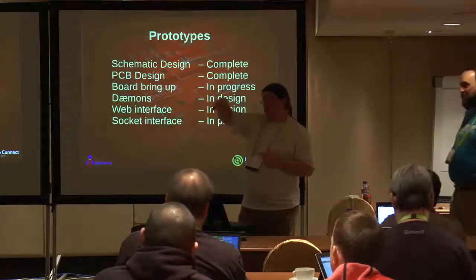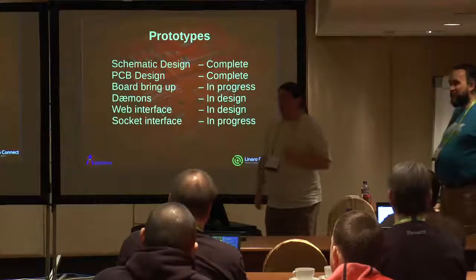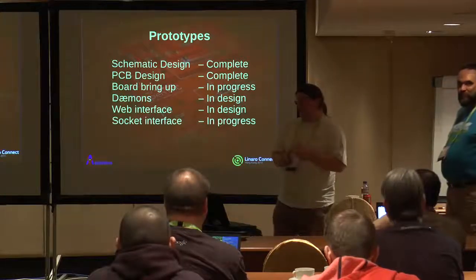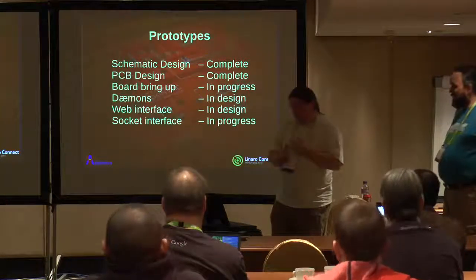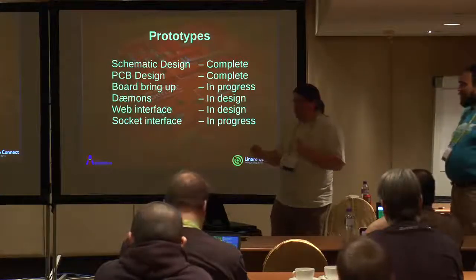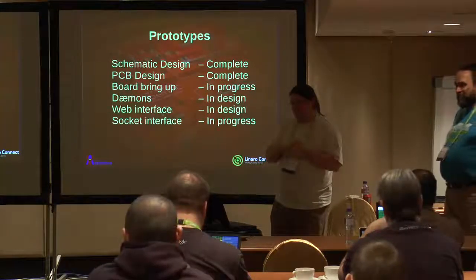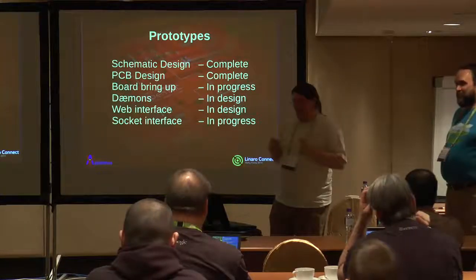If we stack boards, then we're going to end up with an awful lot of PCBs interlinked. Connectors are the bane of your life. They are unreliable. FFC connectors, you can really only insert 10, 20 times before you need to change them. USB is controlled impedance. If you go out through a connector and back again, you're now looking at quite exotic connectors to maintain that impedance, which is not the same impedance as the I2C and control lines should be. So you end up with multiple connections for stackable boards.